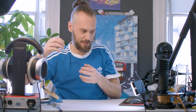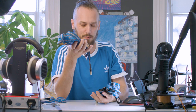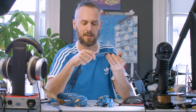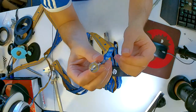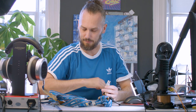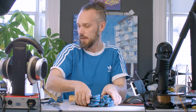So that's the HE 400 project coming along. The swanky cables are now available — listed on the website. We're only doing balanced versions at the moment because I think you get the most benefit from balanced due to the lack of crosstalk, with the wires so far apart. These are our new rhodium-plated copper 4.4mm connectors with an extra-wide 9mm hole in the back. They took ages to get made but they're really nice — good heft to them, being a huge chunk of copper — with copper rhodium connectors on both ends. They've gone through final testing and are ready to go.